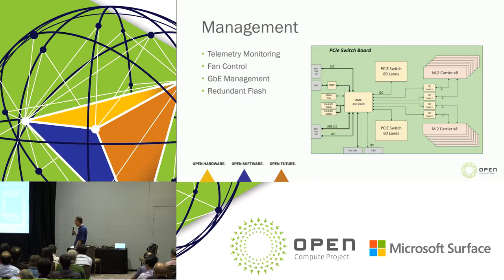One nice thing about Lightning is that they took into account that when you hook up a server to an expansion box, the server needs to have certain information. There are a lot of pitfalls. For example, you don't want your server booting up first and then your expansion box turning on later, because then it never finds it. Through USB 2.0 and I2C, which were added as a standard into the cable infrastructure, the server is able to gather knowledge of what's above it. It can find out the boot state and statuses. So it enables management sideband between the head node server and the flash expansion box.